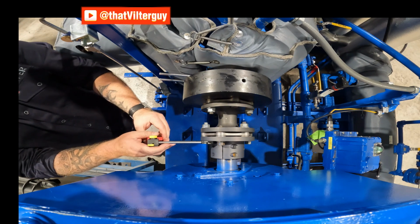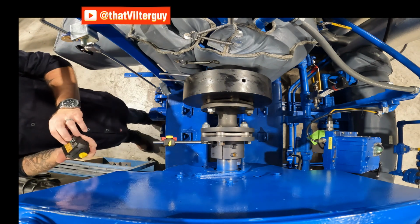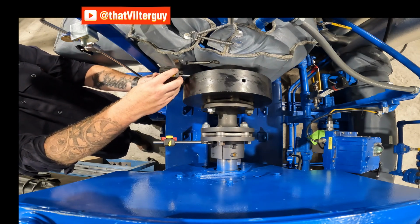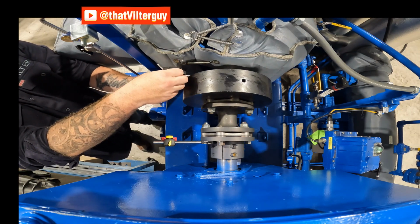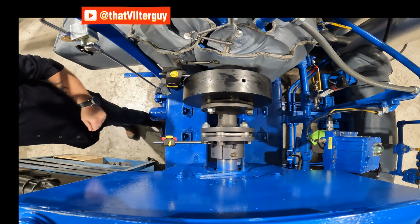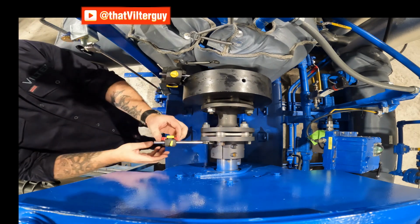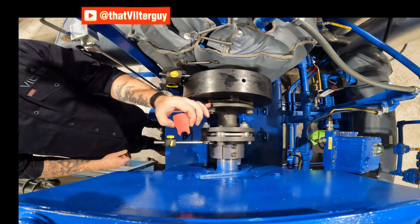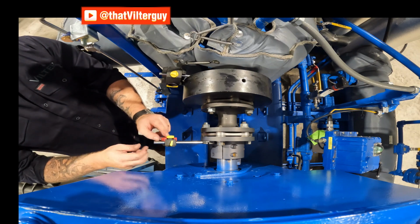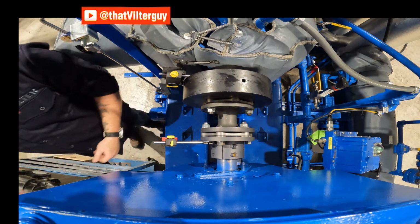I like to put the reflector on the piece that's going to be getting moved. Mount the reflector, the laser. Now this is a nice kit because everything is wireless. The only downside is you have to make sure it's charged up and ready to go before you leave. So once you set it in, you're going to get this crosshair located on the reflector. So crosshair, this is going to beam a light into it, and we're just going to set it up, get it nice and close. Just get it for that initial measurement.